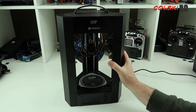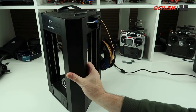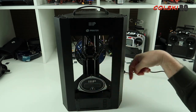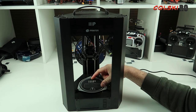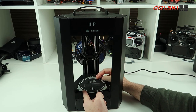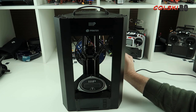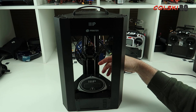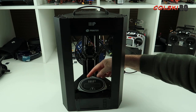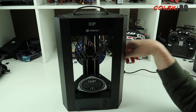If you buy one of these and it ever gets stuck — it's happened once to me — you have to reset everything because there's nothing you can manually adjust. On the card, for the first print, you put that in and hit print and what it will do is reset the printer. It'll come down and measure three points on the plate, which does not move, and that's when it gets its level. Even if the plate were a bit warped, it would still print fine. It won't do that on every print unless you want it to by including the g-code. I did that for a couple of prints and got bored — I don't need to bother. Now I just bang it in, hit print, it comes down, measures three points, and that's as much as you need to do.